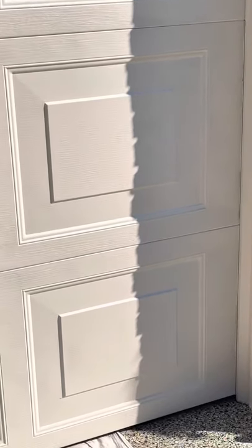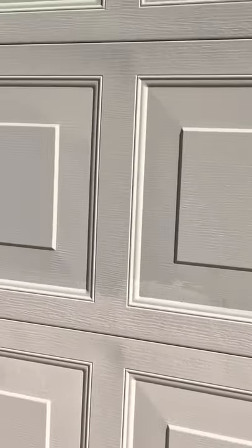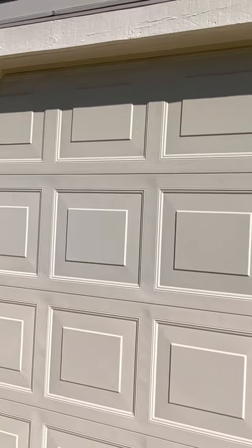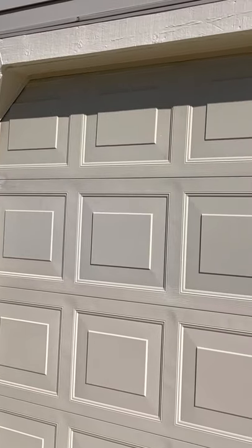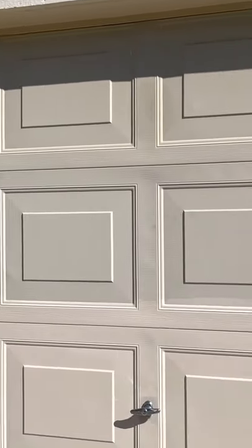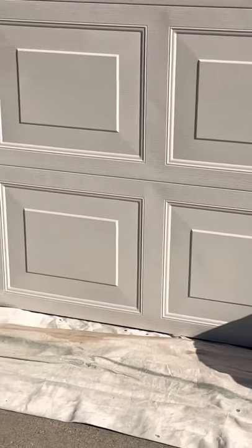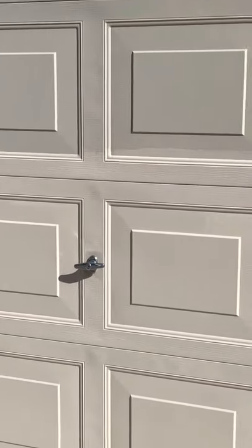The easy way to paint your overhead garage door — I'm in the sun now. If it's really hot outside, 80-90 degrees or even 75 degrees, you don't want to paint in the sun because it'll basically bake the paint. It'll say that on your paint can, so be careful. Right now it's in the 60s, beautiful out. I started from the bottom with the garage door up, lowering it for every run.